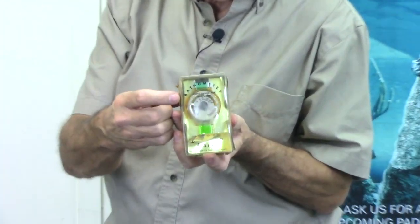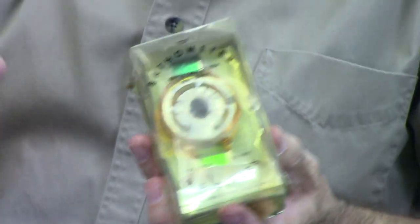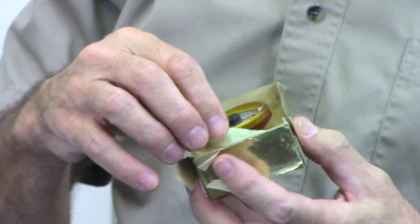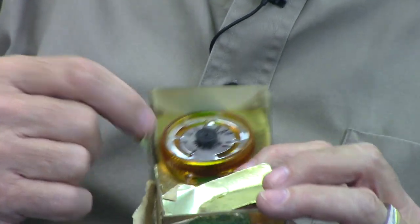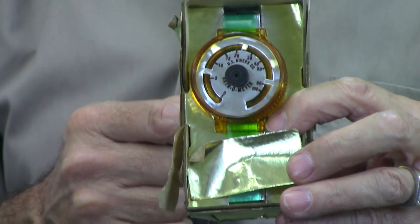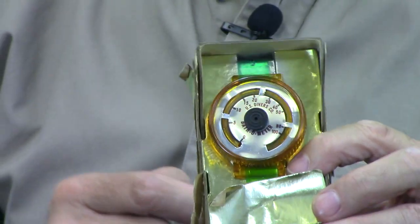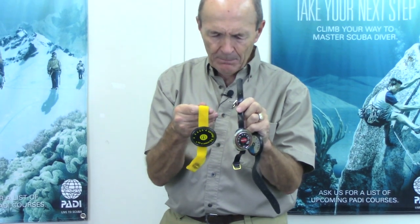Here's another sample — same company, U.S. Divers, big company at the time. This one is called a Bathometer. We didn't even know it was a depth gauge. Bathometer basically means pressure meter — and a depth gauge really is a pressure meter; it's not measuring depth directly, it's measuring pressure, then showing feet. This is the same capillary gauge concept but the tube is now circular, starting at zero, going to 30 and on around. This one is actually in meters — U.S. Divers Aqualung, made in France, very early as well. Companies got more and more sophisticated, but most had capillary gauges: here's a Dacor capillary gauge, a Scuba Pro capillary gauge, a later U.S. Divers capillary gauge — later models, a little fancier, a little more color.